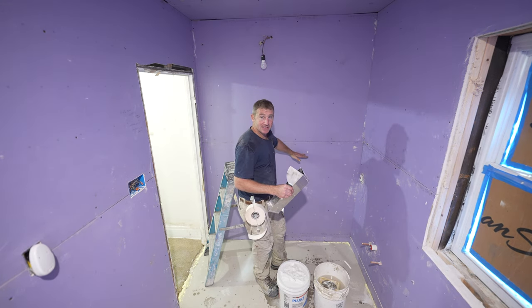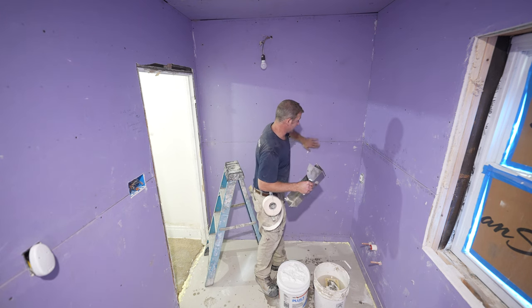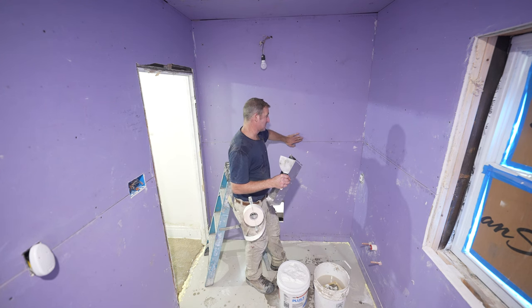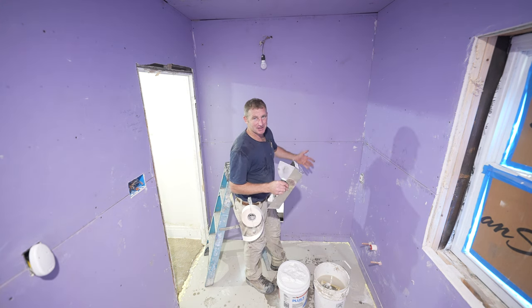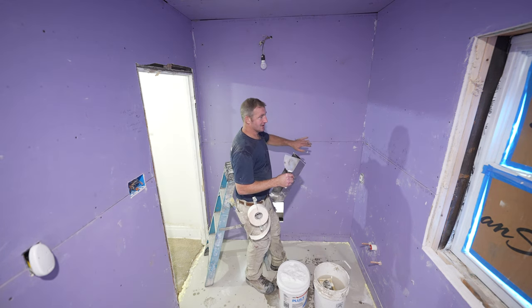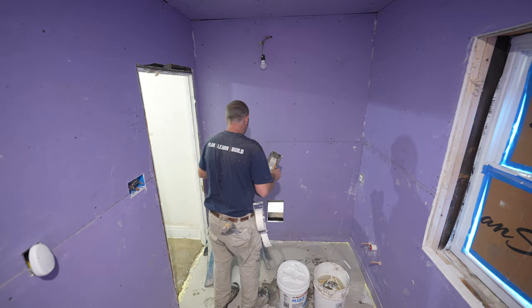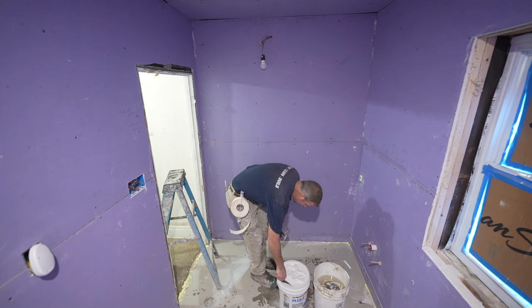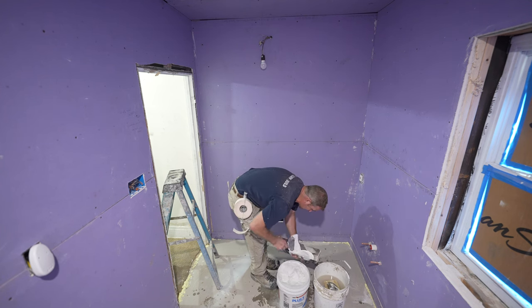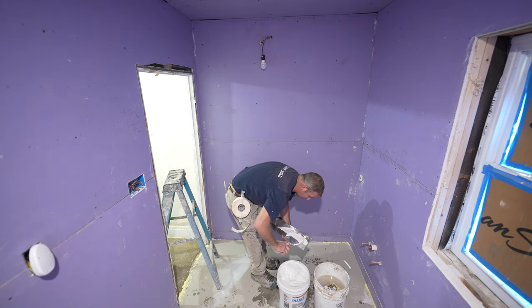In this particular situation I'm going to be down about 48 inches. This is actually a pretty tall room — about 8'6" — so my seams are a little bit higher than normal. You still end up having finishes most of the time if you're doing a wainscotting at 48 inches because you still have this bevel that you're going to have to mud in. Do your flats first and then corners, and make sure you have plenty of mud underneath that tape. That's the biggest key — making sure you have enough mud to prevent any of the paper from lifting.